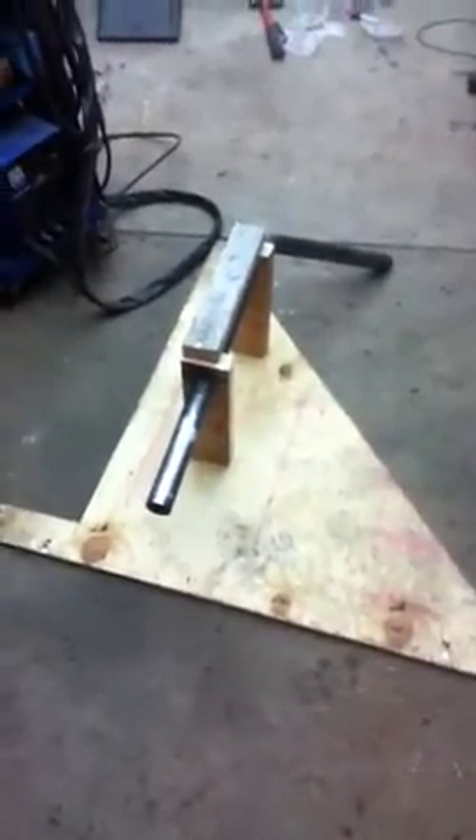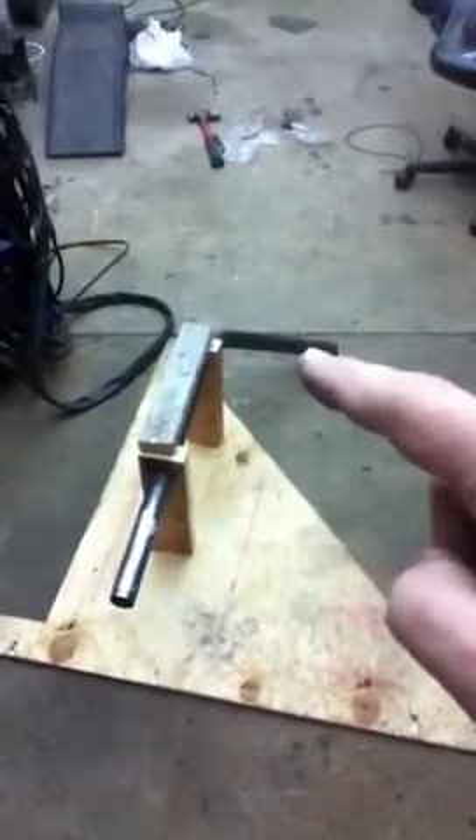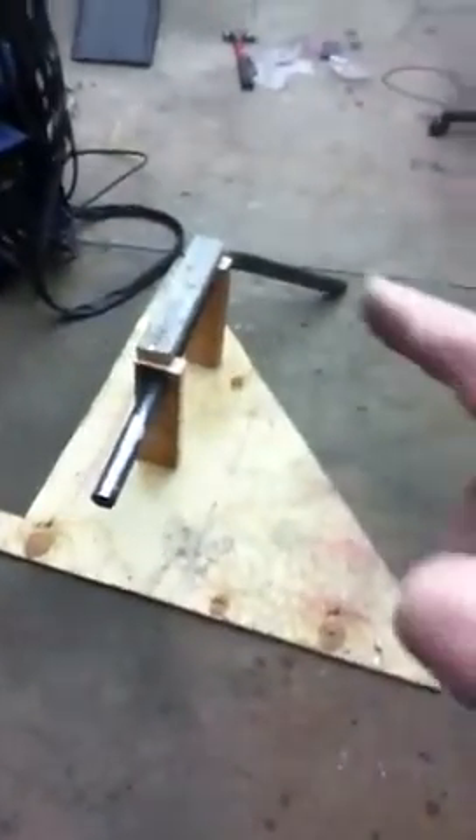As far as the cone goes, this was the template we used. We cut a piece of metal out to that size and built this little quick frame with a piece of pipe. My son would work the handle on one side, we'd tack the piece of metal here, and I'd heat it up with a torch while he rotated the handle as I rolled it over. We both worked together to get the cone shaped — it still had some waves when we were done and it's not perfect, but it turned out pretty good. We have a one-inch diameter ignition port welded in place.